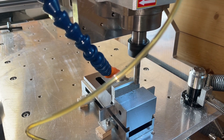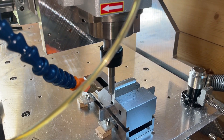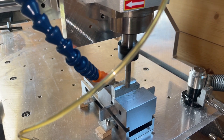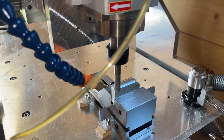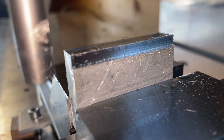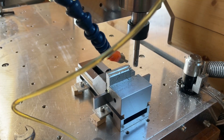After I saw that 0.15 millimeters worked fine, I increased the feed speed from about 300 millimeters per minute up to 600–700 millimeters per minute, and this also worked fine. After that I increased the depth of cut to 0.2 or 0.3 millimeters, though for that I had to decrease the speed. The surface finish came out really good.